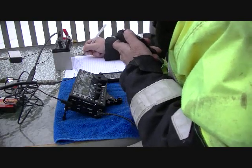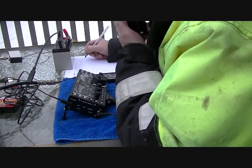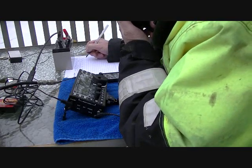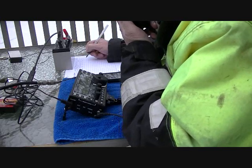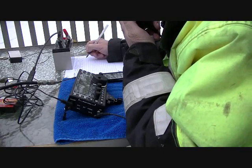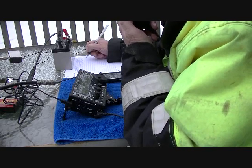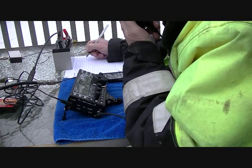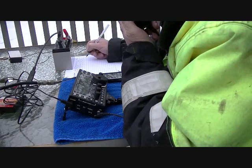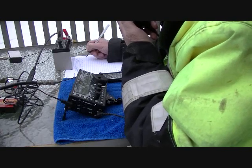Very good, Tony. QSL. I copy your five watts, QRP from Norfolk, England. Callsign Golf Zero Hotel Uniform Zulu. And very good — I am running an Elecraft KX3 transceiver at about 10 watts right now, battery power portable, running through a homebrew open-end fed antenna I made just about two days ago. You are my number three QSO on it. I've just gotten Ireland a moment ago, and now I've contacted you, Tony. Very lovely to hear you on 10 meters today.